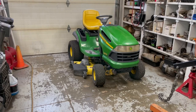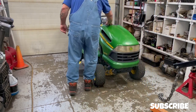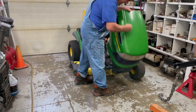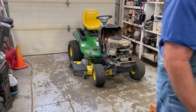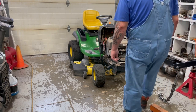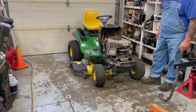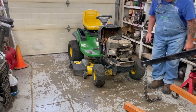I hope you enjoy the video. I'm going to go ahead and take the hood off — I don't want to damage the hood when I lift the front end up. Unplug the lights, get it in the right spot and it pops right off. These hoods on these John Deeres are really expensive, so I'd rather take them off. We're going to jack this front end up — put the jack right in the center here so we can jack it up and see if we can straighten the rods or replace them.